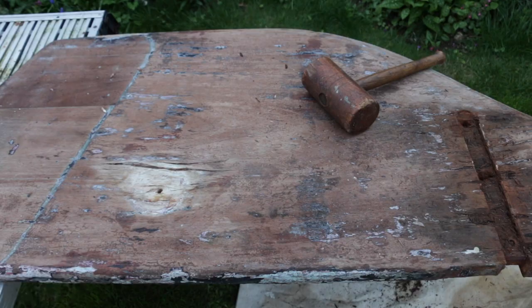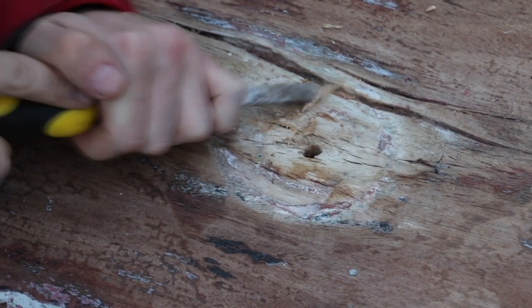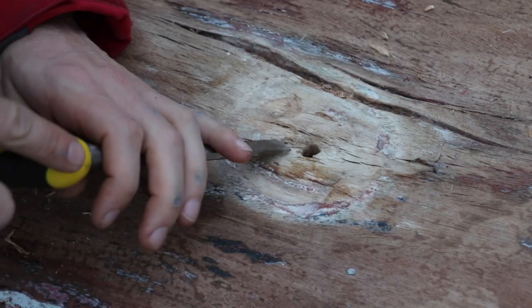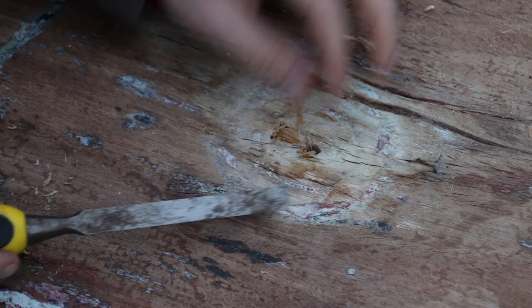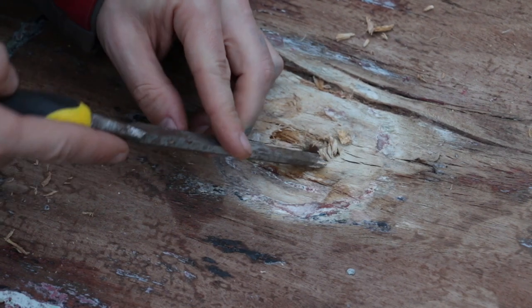There's a section where there was an anode in the middle of the rudder and the wood's kind of gone this bleached color. It's made out of mahogany from what I can tell — the rest of the boat is made out of mahogany so that kind of makes sense. The bleached wood still looks quite hard but it just doesn't look right. There are splits in the grain and it's a very white color. I think it's definitely rotting in some form.